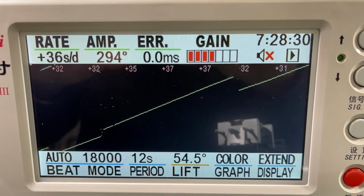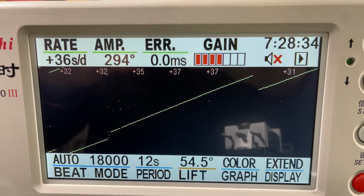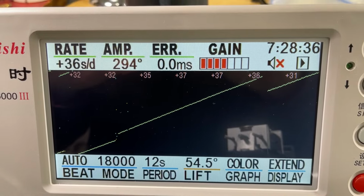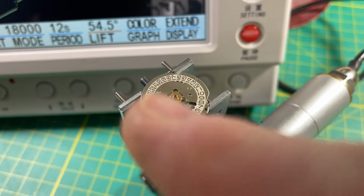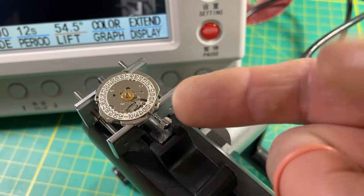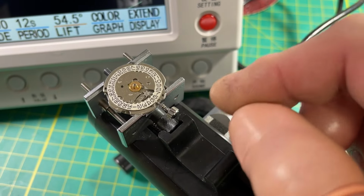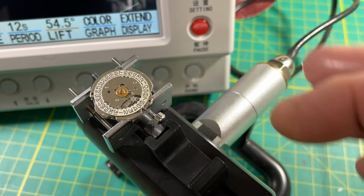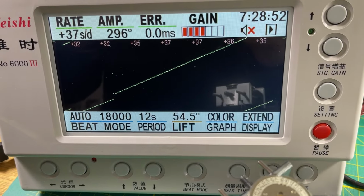Great, so I was able to fix that hairspring, cool. It's always better to fix something than replace it, if I can do that, man. Boy, that's steady. Isn't that steady? Okay, so the reason I'm doing this backwards is because I've got to finish cleaning the dial and then put the dial in here, because the dial is an integral part of holding the calendar together. Seiko got rid of that design later on, but...